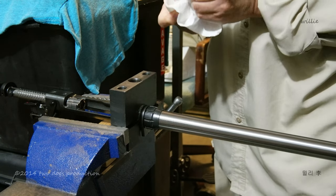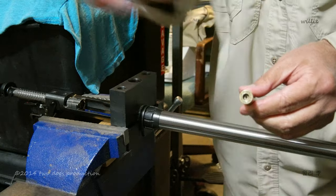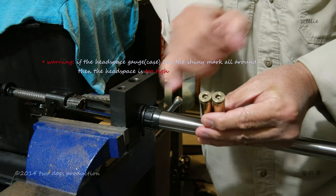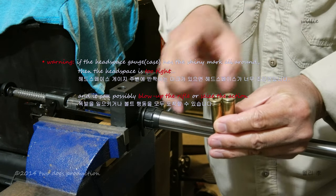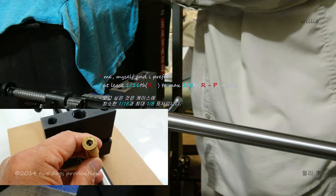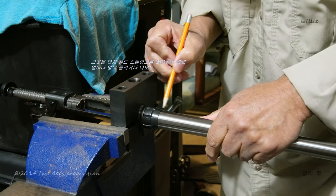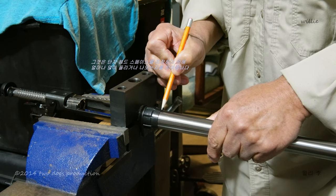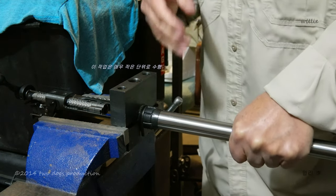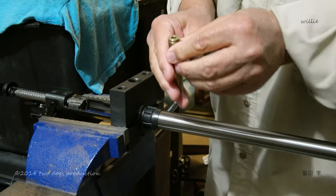What I should have shown you is the case does not have any mark on it. Here's the other case — as you can see, the shiny mark goes all the way around. What I'd like is at least a one eighth mark. Now I have to make a fresh mark. This shows you how much you turn in to adjust the headspace — you have to do this in very small increments.